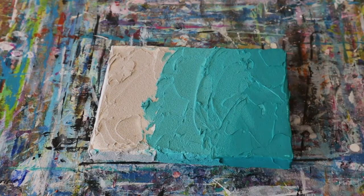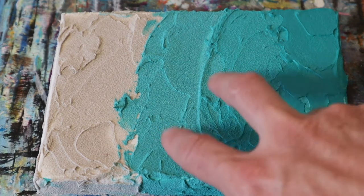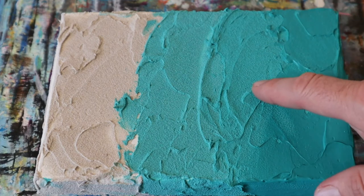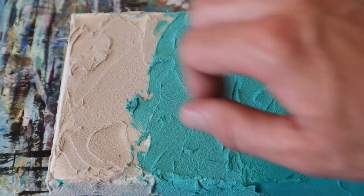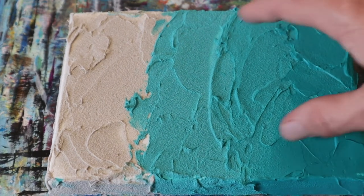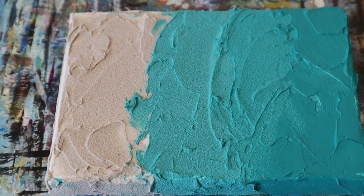Obviously there's no paint in this one, clearly. So these two are where we really want to focus — you can see this one is gray because there's no paint, and this one is a nice solid saturated color because it's just straight paint. But these two, if you look here, you can see some undercurrents of gray tones thanks to the mixture, and this one definitely looks more saturated. Now we're going to apply paint to the surface and see what it takes to make all of these different variations match — testing how much it takes for the stucco to absorb the paint and what the paint looks like once absorbed, and whether we can get it as saturated as the straight paint while still having the texture showing through.